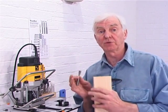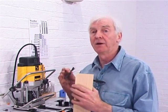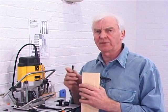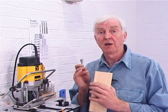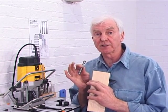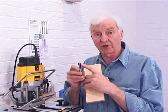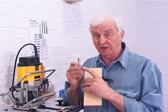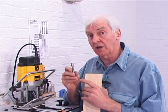Whereas the industry has almost entirely gone over to tungsten carbide tipped or TCT cutters, the Woodrat is alone in recommending high-speed steel bits. We make no apology for this. If you're looking for a slim and elegant dovetail pin, you don't want chunky cutting edges welded to the structural shaft of your bit, even if they do never need sharpening. Here's the difference with the cutters.